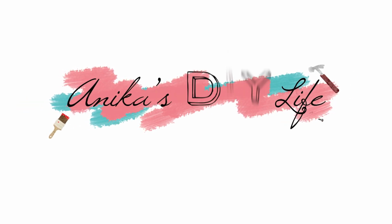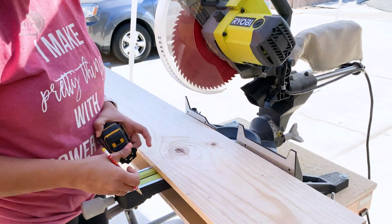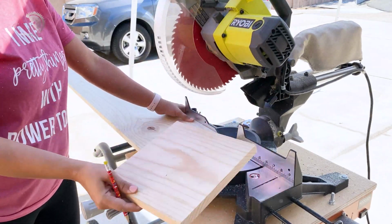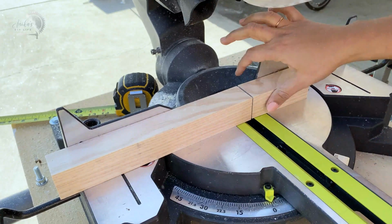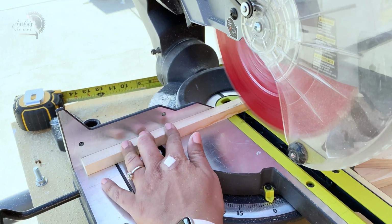Now let's get started. I cut up a 1x10 board I already had to get a square piece for the board. You could also glue up a couple of smaller width boards if you need to. The sides are made from 1x2 boards, so I cut those up. And the inside grid is made using 5/8" dowels, which I cut down as well.